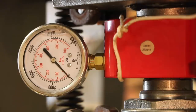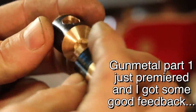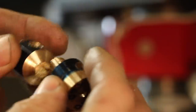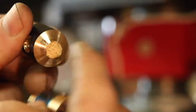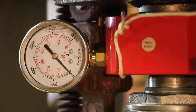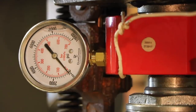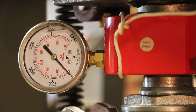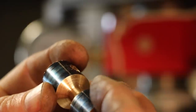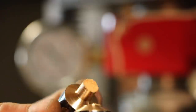Boy, it broke really quickly. So I just finished watching my premiere, and Brandon pointed out that it might be the way I'm making my samples — that this radius here is not adequate. And this did break at the edge again. So using green sand with a bigger pour did not help; in fact, this one was a little weaker. Next — I've got the bottom portion of the metal mold. It got to 400 and you really don't start seeing anything until 400. Got to 500 and broke. Grain structure might be a little bit finer, but it also broke at the junction. I think Brandon's on to something.